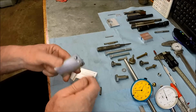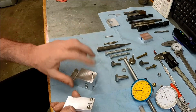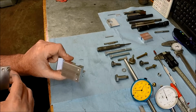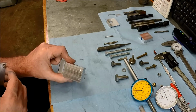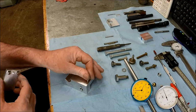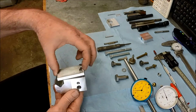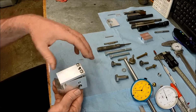So these guys are gonna work like a little hinge. And we've got our pin in the block there. That hole's a 1/2 inch deep. We got a couple little dimples we made with a chamfering tool. They're also at the 90-degree included angle. So there you have it right there. Okay, so that's going to be our little hinge. Happy the way that came out.